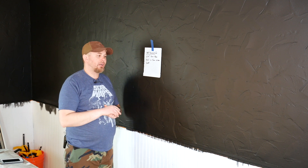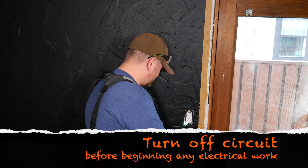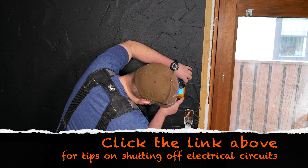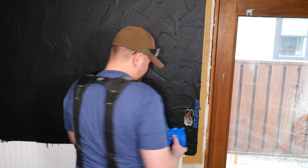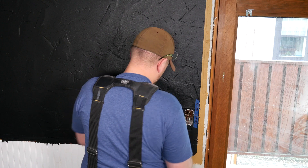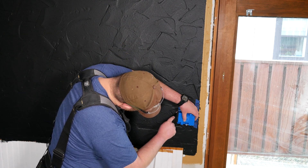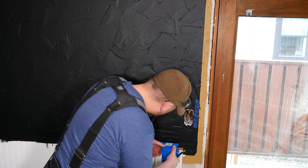I'll go ahead and get started. The first thing I'll need to do is remove the single gang electrical box and install a double gang box so I can install a second switch at this location. I'm using a stud sensor to verify which side the existing electrical box is nailed to, which will show me which direction to enlarge the opening in the drywall. Before you start cutting, disconnect and remove the existing switch and push the wiring out of the way. Then grab a pen and trace around the face of the new electrical box as a guideline. A small torpedo level can help start things off straight.